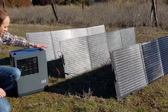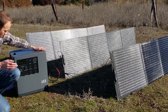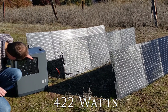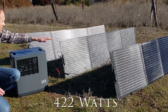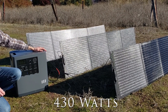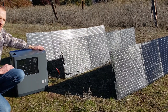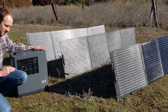Now I have just three solar panels connected — theoretically that's the minimum if you use the Mango Power Solar Move panels. I'm sitting right now at 422 to 430 watts with three panels connected, which would be the minimum voltage of somewhere around 60 volts. So 600 watts of rated solar panels producing 430 watts — that's pretty good efficiency for not being at the perfect angle. That's easily remedied with a very inexpensive extension cord; I ordered mine on Amazon and it should make this setup more efficient.